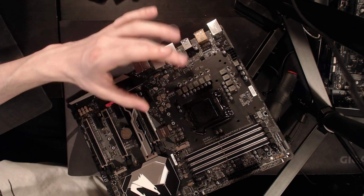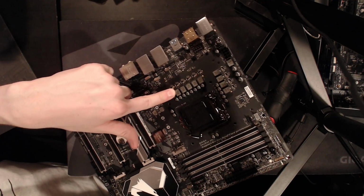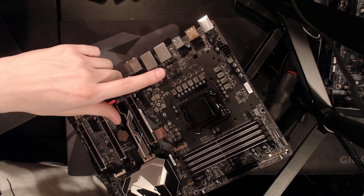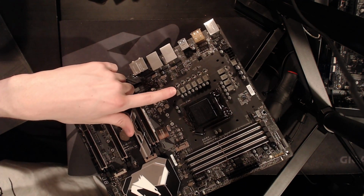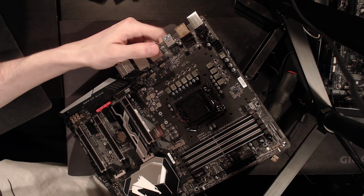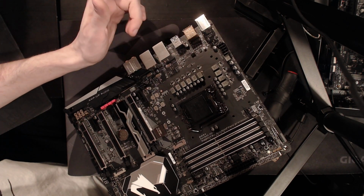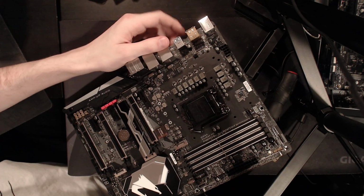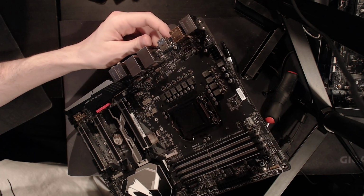And yeah, so basically this is a really solid VRM. Also, the chokes Gigabyte is using here, they've used these on some other boards as well. And off the top of my head, these max out at 60 amps output. Basically, this VRM is totally overkill. They're like 60 amps at 125 and 70 amps at 25. So basically, they derate as they get hot. But either way, these are also really, really high-end chokes, which is neat as well.